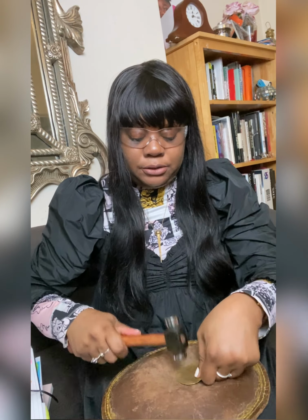So that's continuously, it's already taking on another shape. Normally this is actually work hardened, so normally you would want to anneal it just to get it maybe like a cherry red annealing, so that it's more malleable. At the moment I'm doing it as a work hardened metal, so it's going to be more work for me, but for your future reference it would be good to anneal your metal before forming it at the sandbag.